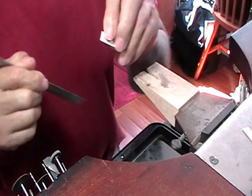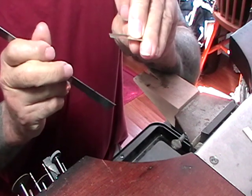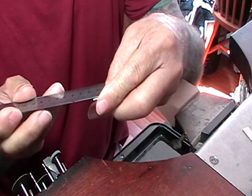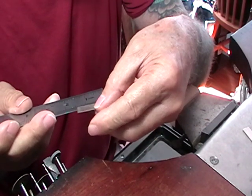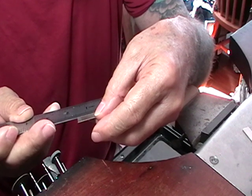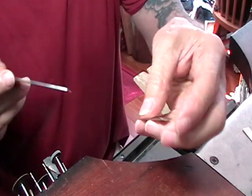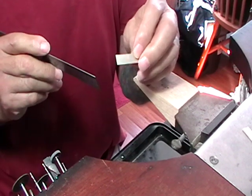The metal you need for the earrings is 0.5 thick fine silver. It's 35 millimeters long, 10 millimeters wide. Imperial, or the old money, it's 1 3/8 long and 3/8 wide. Don't know what the gauge is, 0.5 millimeters thick.